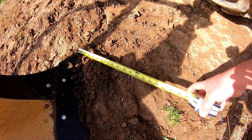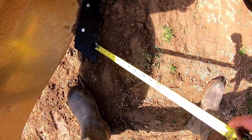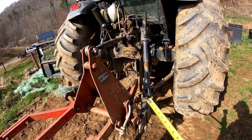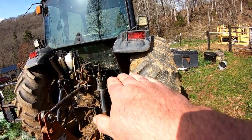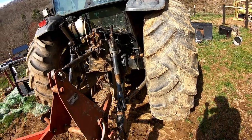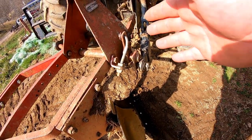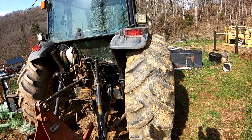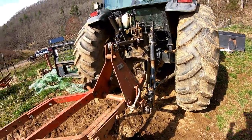That's why you set your plows laterally — from the tip of this point over to the edge of this tire needs to be 14 inches. You'll get this first furrow cut right. You can always tell if your lateral is out of adjustment by looking back at what you plowed. On a three-bottom there'll be two nice uniform furrows, then one that's a little bigger or smaller. If that one's bigger, the front one's probably cutting too much; if smaller, it's not cutting enough — 12 inches or 16 instead of 14.